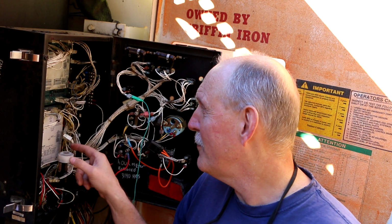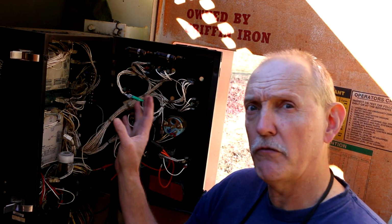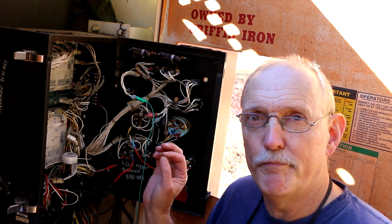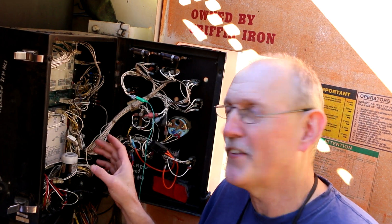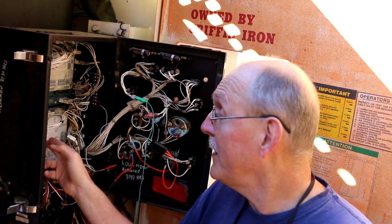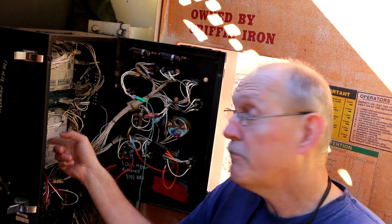But I don't get it, because would all those interlocks be overridden by, well, I guess yeah, the ground control switches pretty much do override it, because the ground control switches are very rudimentary. All we're doing is sending 12 volts to the solenoids. So I'm going to see whether or not I can get this board out of here and get it on the bench and just do some rudimentary basic testing, real hunt and peck, flying in the blind type of diagnosis of this thing. In other words, if I'm lucky, I'll find some bad connections on here, which I kind of doubt. Why would both of them be bad at the same time? However, what I might find is there might be some driver transistors or buffer transistors in that circuit, on that output leg, that for some reason have failed. That could cause this problem.